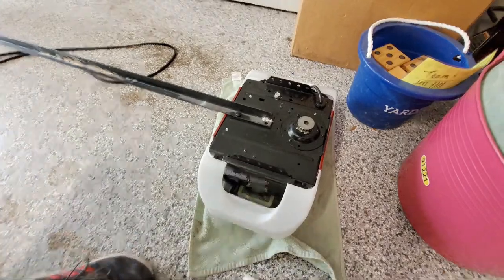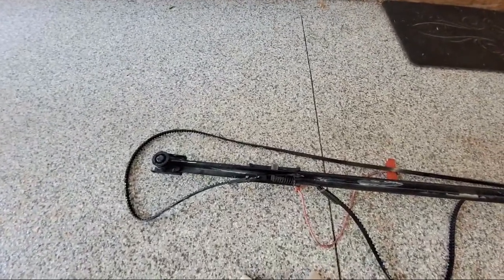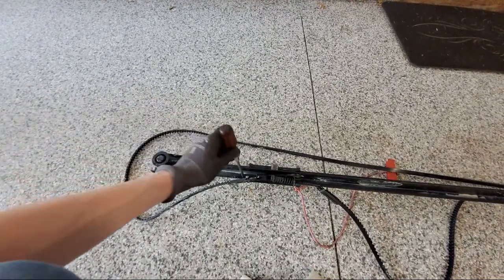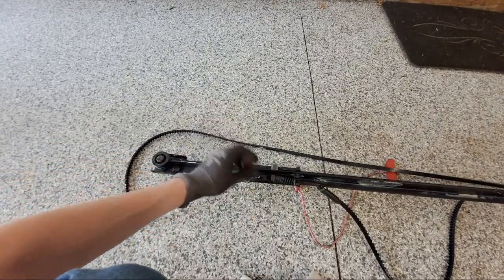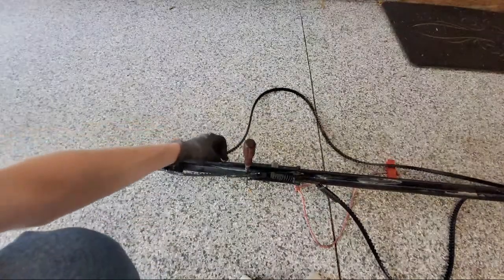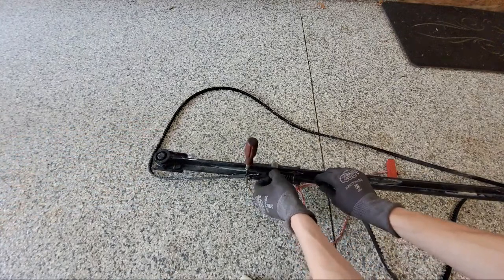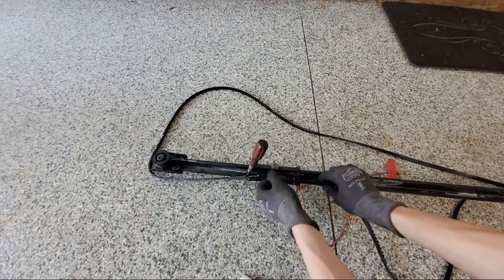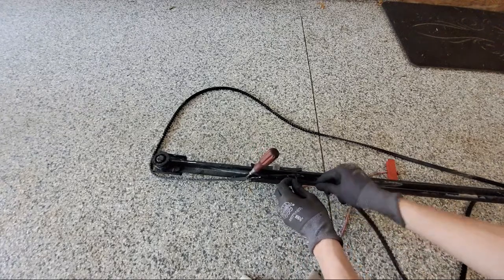And actually, I'll show you a little trick I like to use. When I'm putting the belt or chain, whatever, on, you've got a little hole on the rail here. I like to just stick a screwdriver in that. That way it doesn't move the trolley around. It keeps the belt in one spot, and that keeps the trolley pretty close to where you want it set for the down limit, for the arm and everything.